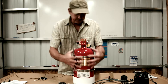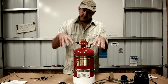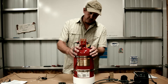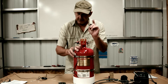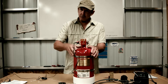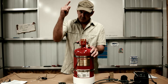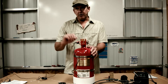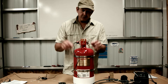Let's talk about the bottle itself. This big red bottle holds our extinguishing agent, which is liquefied and held under pressure. These come in many sizes, from very small up to massive systems for large spaces. This one is sized for about 350 cubic feet. To measure your space, you take length times width times height to get cubic footage, deduct space occupied by permanently affixed tankage, and use that number to size your bottle.